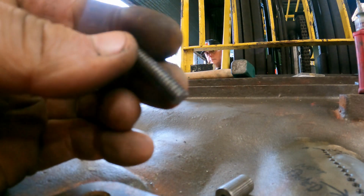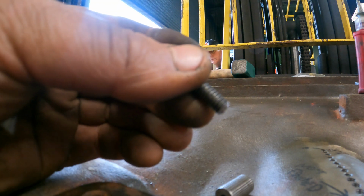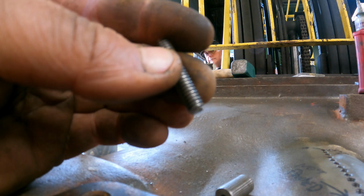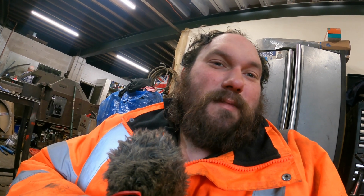Really shallow, just on a bench grinder. Which side have I done? I've done that side. What we want them to be is quite tight in the bottom. We don't want a long taper, because once we break through with the drill on drilling the second holes, that'll snag that and snap that. And on my test piece, I did manage to break 3 drill bits.